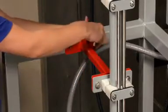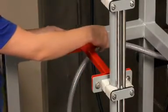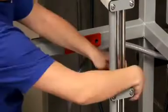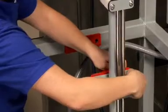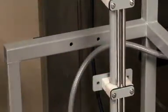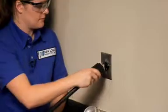Using these two wrenches, remove the 4 bolts that connect the shipping bar to the VSEP frame and the VSEP torsion spring. While removing the 4th and final bolt, be careful that the shipping bar does not fall on the VSEP frame. Also be sure to keep the shipping bar in a safe place, as you will need it every time you do mechanical work on the VSEP.